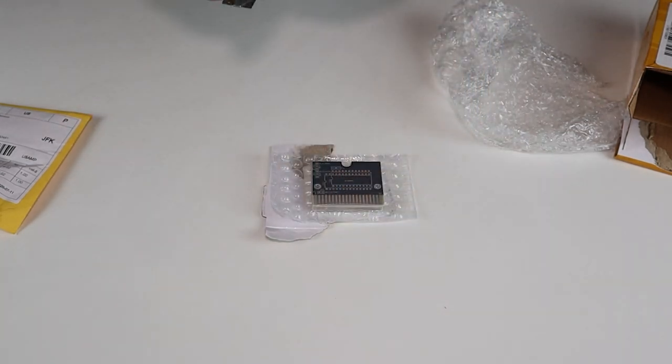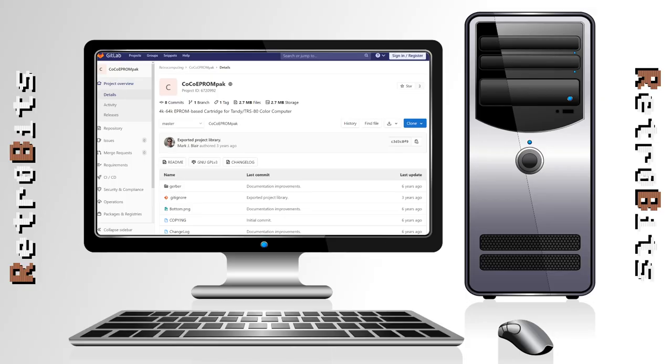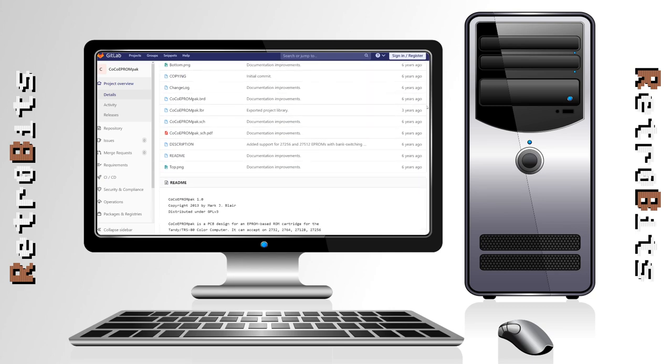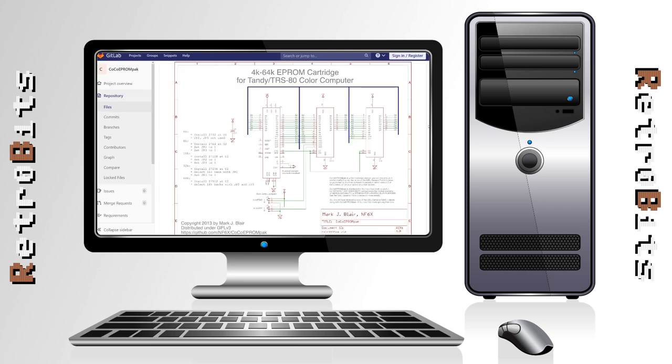I ordered these PCBs from a popular Chinese manufacturer for about $1 each, plus shipping. They were made using the open source CoCoEPROMpak project created by Mark Blair, which I've put links to in the description below. This board, when assembled, will accept EPROMs up to 64 kilobytes, allowing you to store up to 4 16K cartridge ROMs on it and select between them using jumpers.